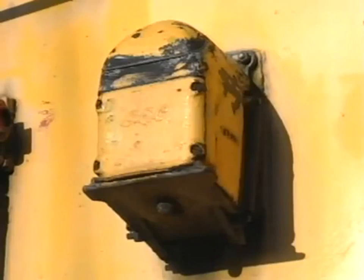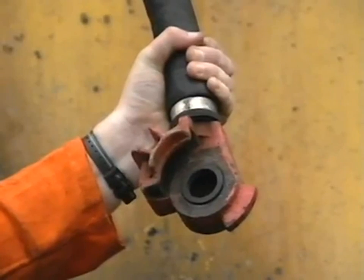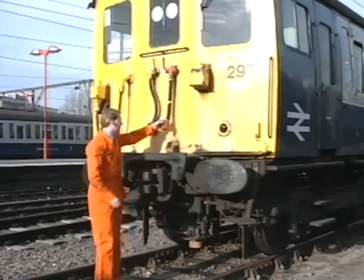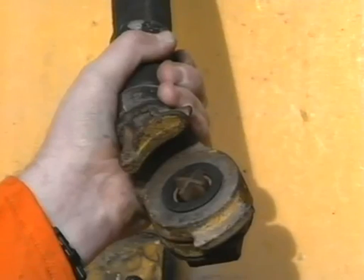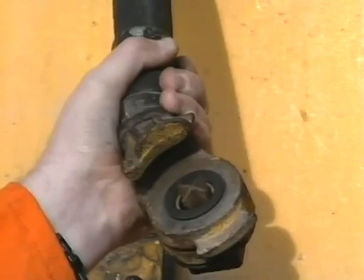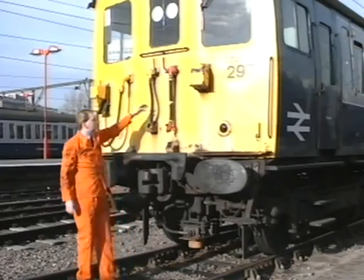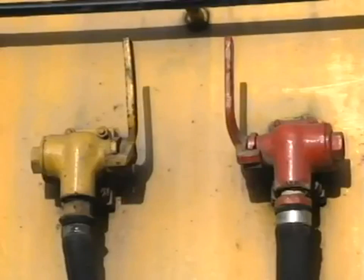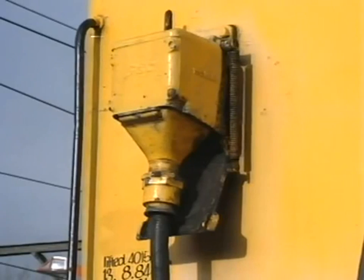On the driver's side is the receptacle for the 36-way control jumper. In the centre is the train brake pipe flexible hose with red coupling piece. Alongside is the main reservoir flexible hose with yellow coupling piece and with a star valve. Each of these flexible connections has a separate angle cock.